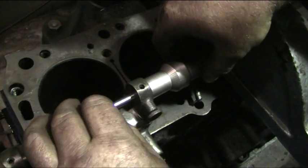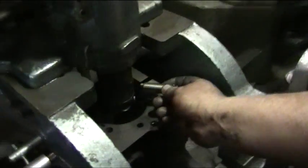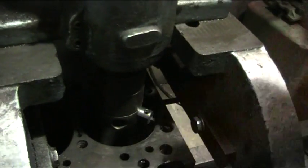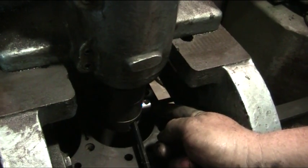Back it off slightly, check it. Then we place the tip into the boring bar itself, into the boring machine. Shove it in, make sure it's snug. Rotate it slightly so we can get the tooling in. Simple Allen key to lock it in place.